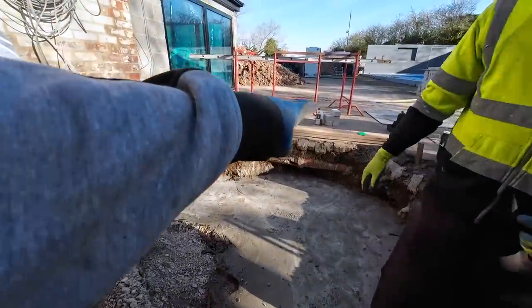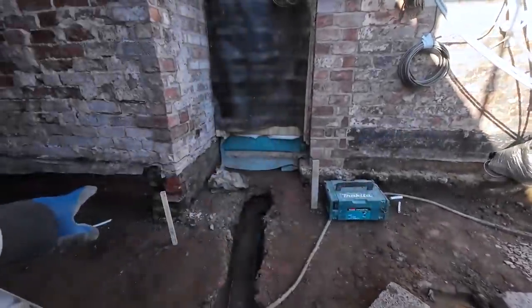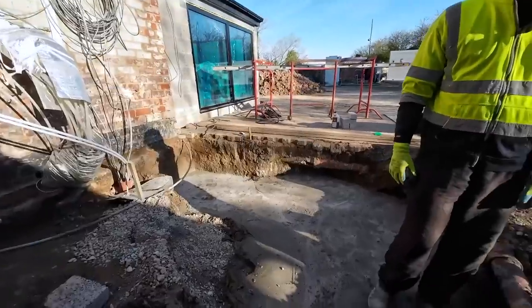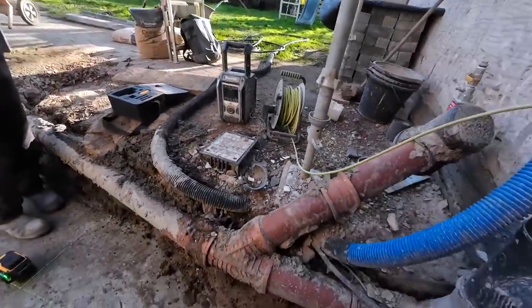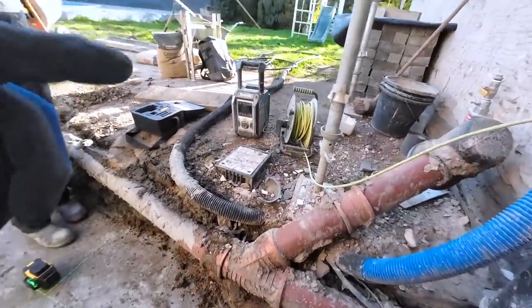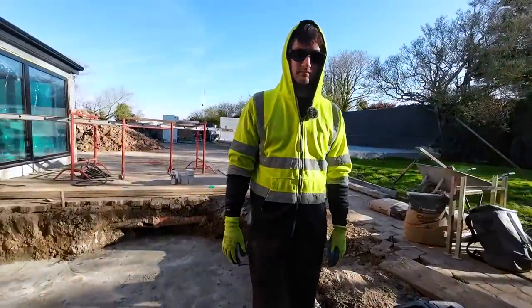I think we've got a couple of pegs there. I think he said the pegs were for the floor level. I think he said about 8 courses, and it's 73mm concrete commons, 2 skins, with a 150mm cavity, our first 150mm cavity.